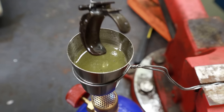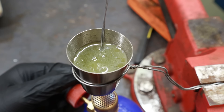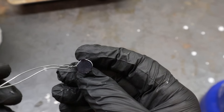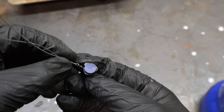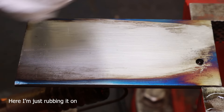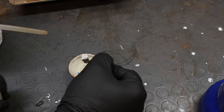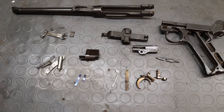Keep in mind, the liquid you see is entirely made up of molten salts — there is no water involved, and as you can imagine, it's quite a dangerous process. Once dipped, the parts will start going through the temper colours, and unless you have perfect temperature control, you'll have to keep an eye on it. Once you've reached the desired colour, the part is dipped in water, dried, and oiled. In a rough setup like mine it's easy to overshoot and get one of the next temper colours. In this instance I was going for straw but got a purple instead. When this happens, the best thing to do is dip the part in dilute hydrochloric acid, which will quickly dissolve the oxide layer, allowing the process to be carried out again.